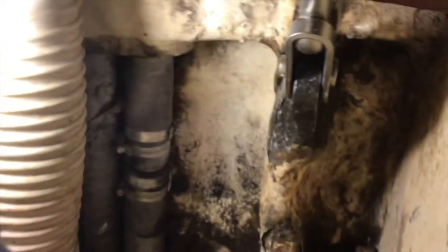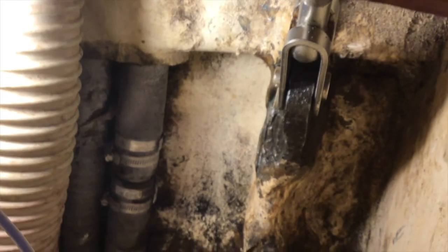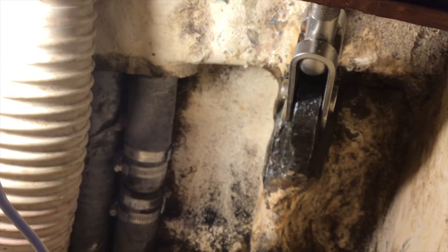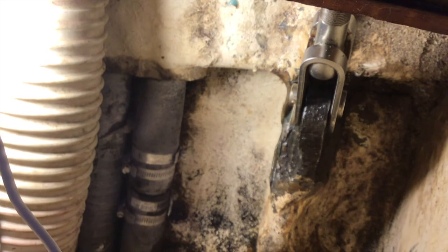So there's nothing wrong with that chain plate. You have to get all the rust off, cover that thing with a marine corrosive grease and use lanolin like on the other ones and just clean them up. And every year, put some grease on them and keep them from rusting. That's my plan. And then I'm going to power wash all that and get all that dirt out, and maybe spray some bleach down there and call it a day.